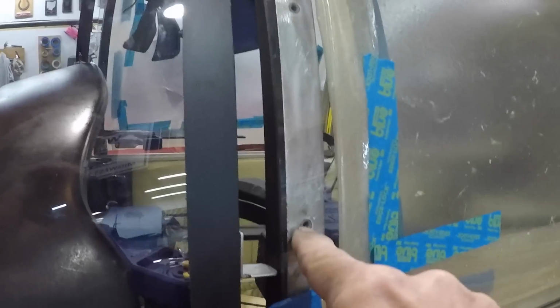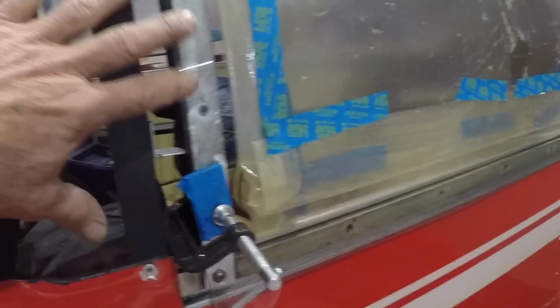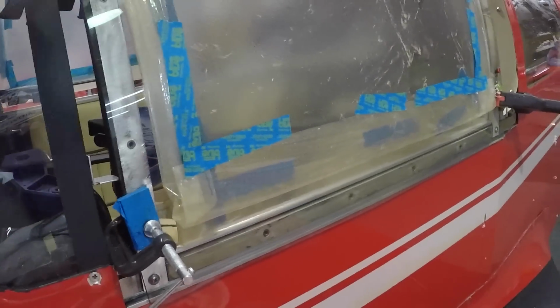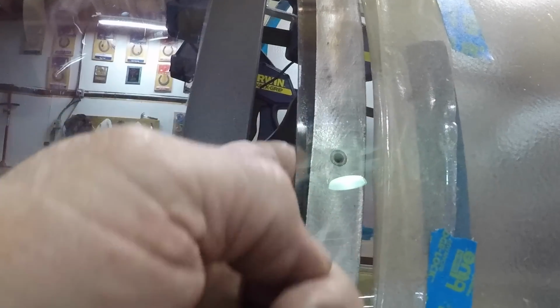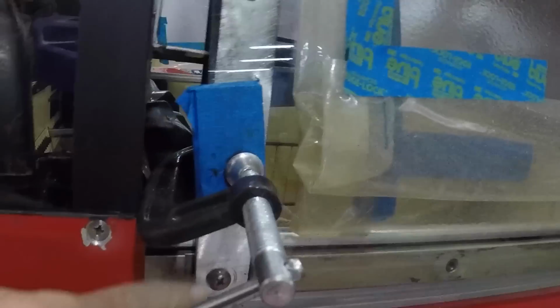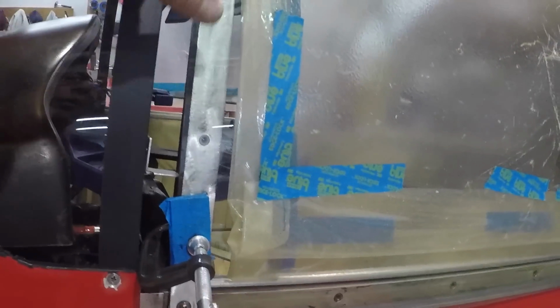Now we're getting ready to take the drill. We're going to drill this hole, two up at the top, and the similar spots on the other side. And then that will give us 6 registration points either side. Because, as you'll notice, the canopy is proud right here. So we're going to leave it proud, but we're flush here, we're flush on the other side, we're flush at the bottoms, and so we have a couple of places where we're a little proud.